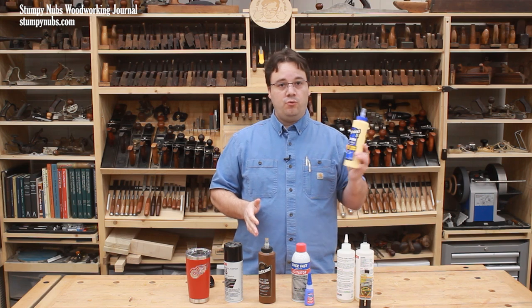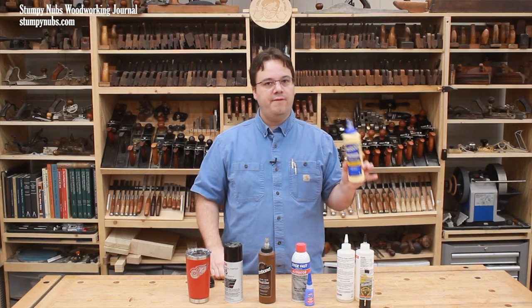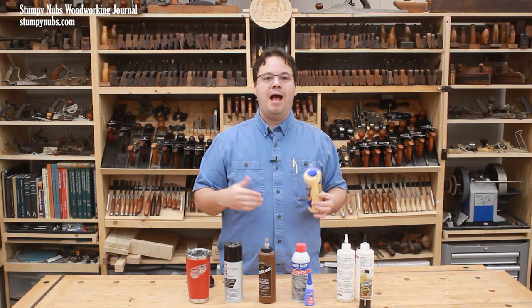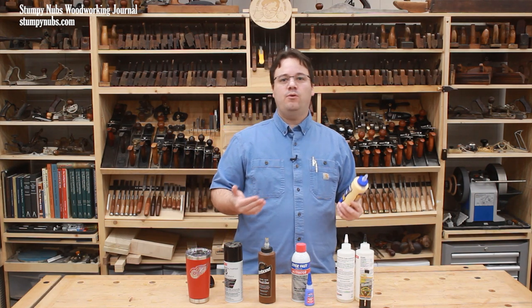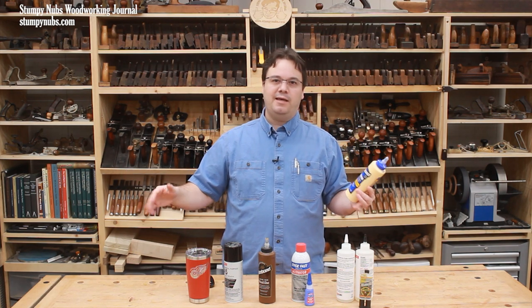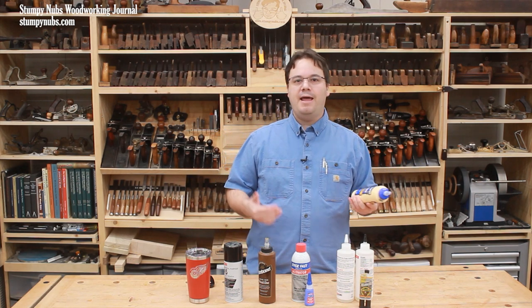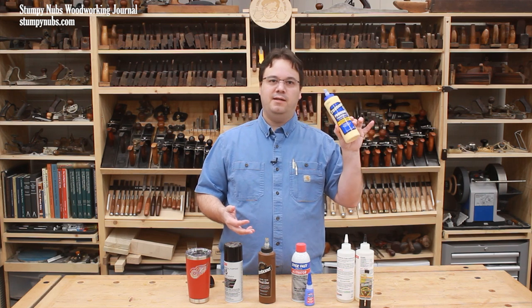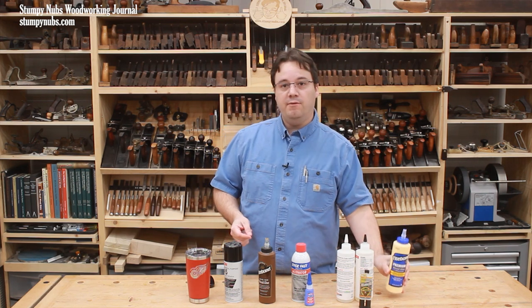If you do all these things, you can reasonably expect a relatively long lifespan from PVA wood glue — under ideal conditions, perhaps several years. I personally limit my glue storage to three years. I think three years is a good limit because I can generally remember how the bottle has been used and stored over that length of time. Beyond three years, I can't always be sure what it's been subjected to, and I don't think the cost of replacing what's left is greater than even a moderate risk of joint failure. Most of us will go through a standard 16-ounce bottle in a lot less than three years, though you may not make it through one of those big bulk-sized jugs you bought on sale so long ago you don't even remember how old it is.